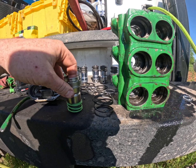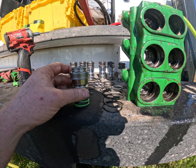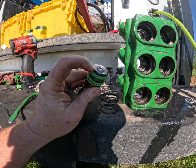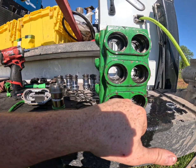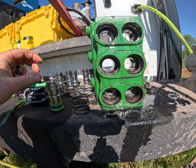All your little balls will fall out when you take it apart. If you're trying to reuse the coupler, you want to put some grease on the inside to try to hold the little balls back in the coupler. Then you pull the actual coupler out the back. Do not take the snap ring off the back here — that's not the correct way of disassembling it. You pull it out and there is a groove in here with an o-ring and a backup ring — change those out.